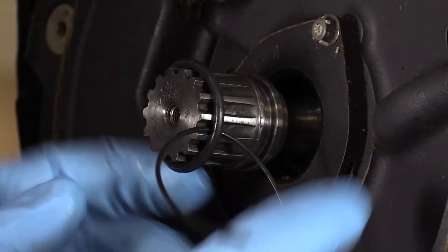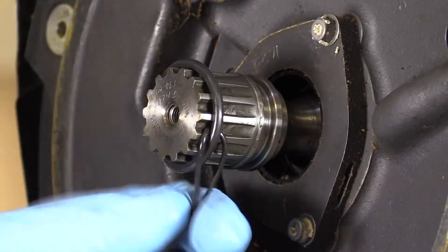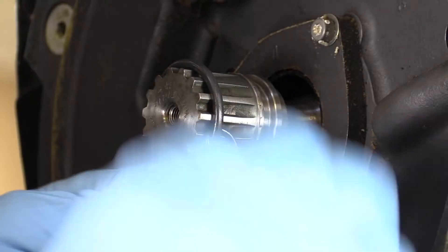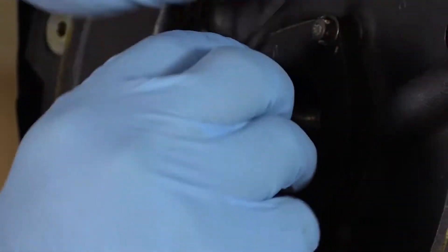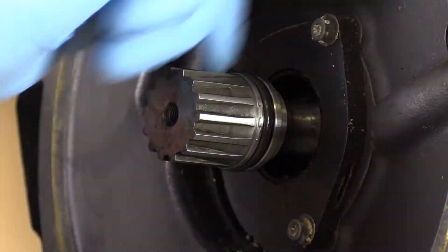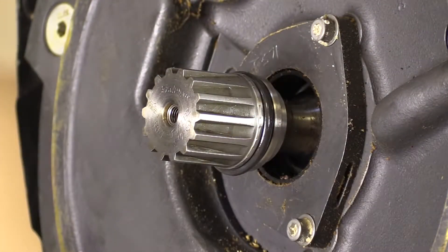The purpose of this discarded old O-ring material is that we don't really want to roll that new O-ring into position, as we'll store twisting energy in it — we don't want that. So we use this piece of discarded packing to loop around, and as we push the O-ring into position all the way back into the groove, once seated, make a couple revolutions around it just to make sure that if we did store any twisting energy, this will remove it. It makes the packing last longer.